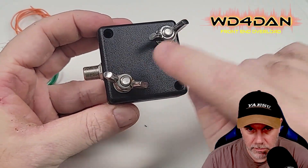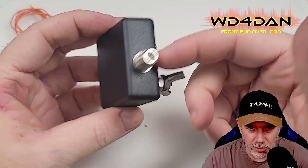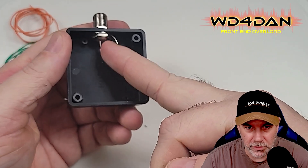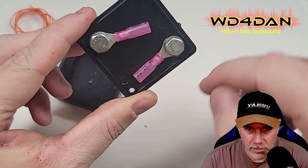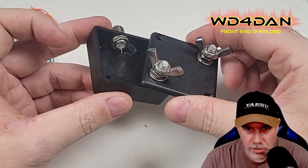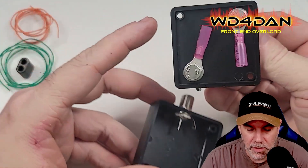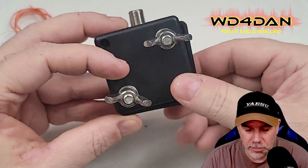We've got holes drilled and everything mounted — our two wing-nut terminals where the antenna leads will attach, and our F-type connector, perfectly centered left to right and top to bottom. The toroid will sit down in the bottom of the box, and the antenna leads connect to the bottom of those bolts with crimp-on connectors with heat shrink. One thing to note: this is not a watertight box. Once you're done assembling, put a little dab of silicone in each of the holes you drilled so water doesn't get in.